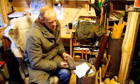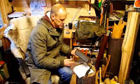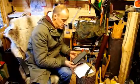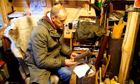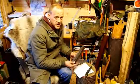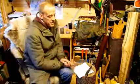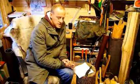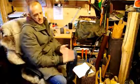Now, water stones themselves can be quite expensive. This oil stone's been in my family for I'm not quite sure how many generations. So this was the first stone I ever learned to sharpen on, just with a bit of 3-in-1 oil, and it works absolutely fine and puts a brilliant edge on. But it's big, it's bulky and it's messy, so it doesn't tend to get used much these days. Obviously, if you're out in the field, you need something far more portable, a smaller stone or perhaps another alternative, and we'll look at that shortly. But to begin with, let's deal with the technique.